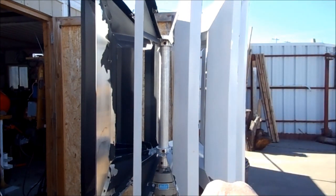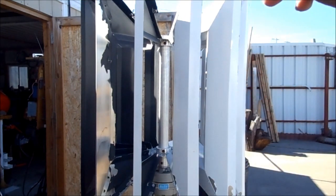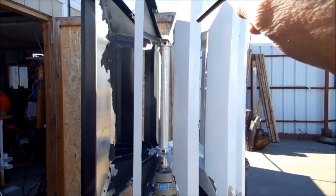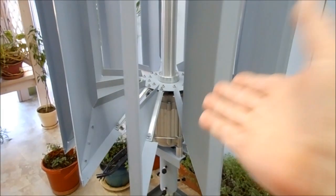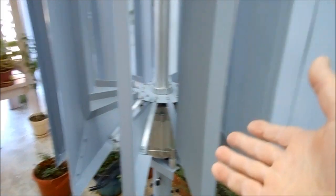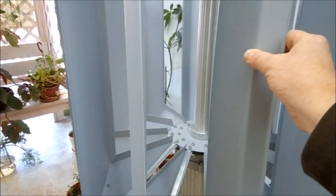If you have your own generator, your own base, your own tube, the turbine should just slide right over that if your tube is just two inches or slightly under. It needs to be round, straight, and smooth — so you may have to have somebody do that, but it doesn't have to be me. You don't have to buy this. You can just set it up where you have that two-inch tube sticking off the front of it and the turbine will slide over the tube.